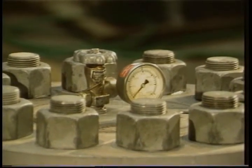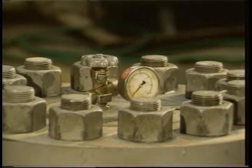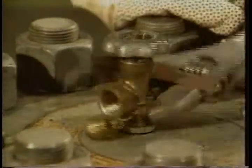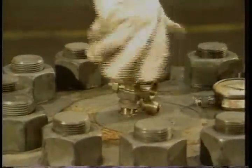After the dampener is depressurized, remember to double check. You're ready to repair it. The first thing you need to do on either dampener is remove the valve and gauge. Just use an open-end wrench to loosen them, then you can remove them by hand.